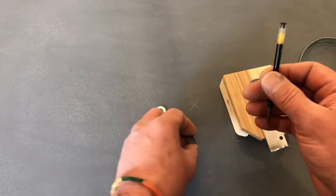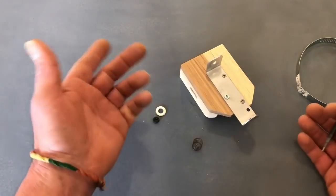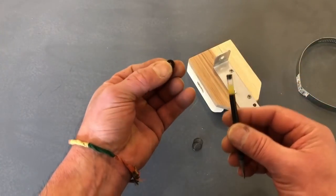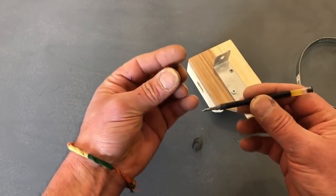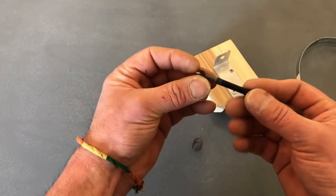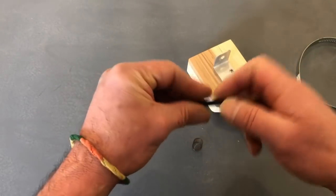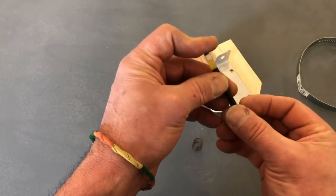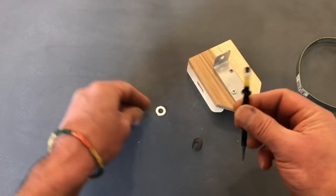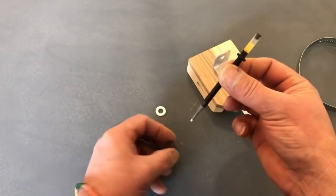You drill this hole, that hole, and make sure you put some mounting screw holes in here to screw it to your wood block. Besides that, you're basically done — I built this entire thing in like ten and a half minutes. Here's the tricky part: what I did was I got a little rubber O-ring from the auto parts store — bought a little assortment pack for a couple bucks — and you find one that fits on the pen pretty snug.